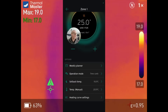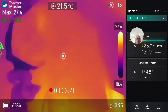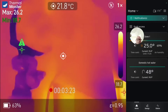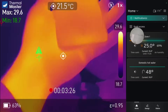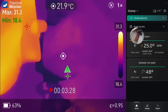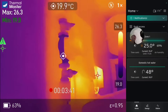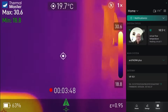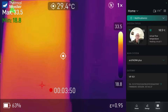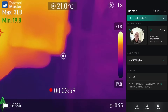I just heard some clicking — some valves. Let's start in the airing cupboard. I open the airing cupboard door and straight away I can hear it's running. The pump is on. I touch it with my hand and can just about feel that it's running. At the moment the pipe's very cool. Flicking back onto the app and going to status, the actual flow temperature at the moment is 18.5 degrees. Let's give it a few minutes.